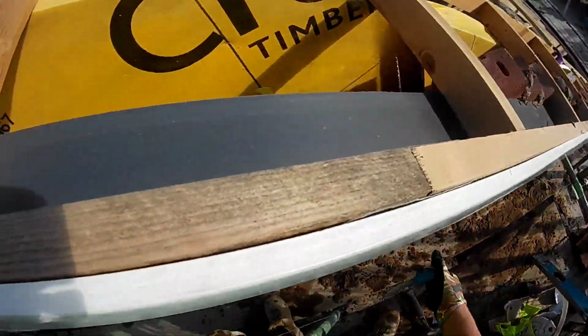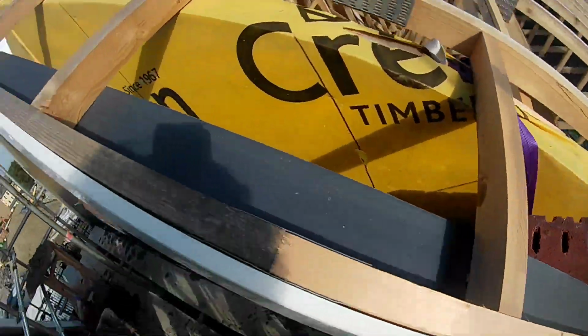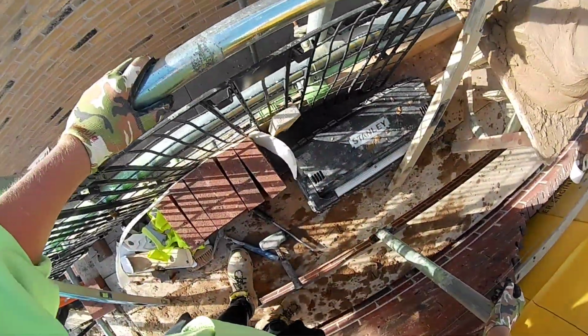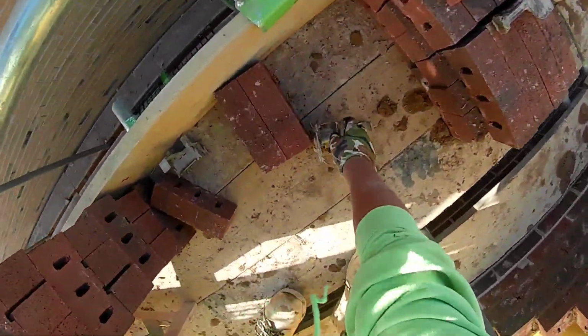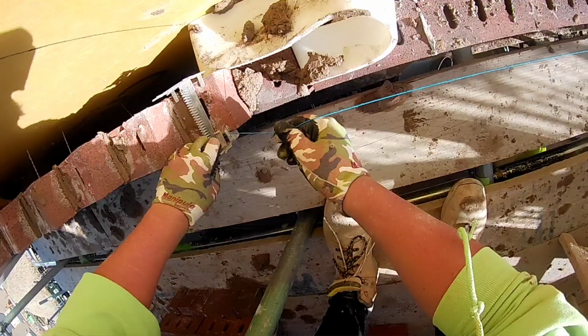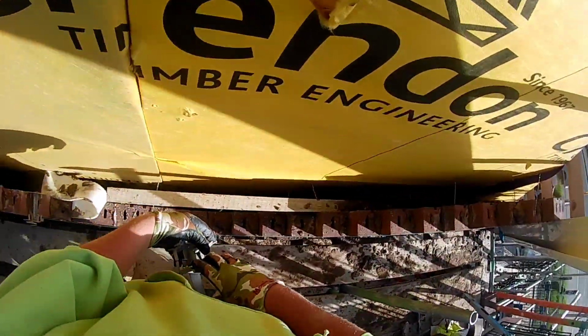So brickwork, a bit of block work backed up, and then on the Tuesday, I'm going to fill in and run a bit of jack wall, half height probably, that'll get us a day. And on the Wednesday, I'll probably finish off the white work and the reveals, and then I might have time to get a couple more courses on the jack wall. I reckon on Thursday we'll be just finishing the jack wall off while Dean loads out the next plot, and we should be able to get a brickwork corner up on the Thursday, and then we'll hopefully see where the weather is by then.